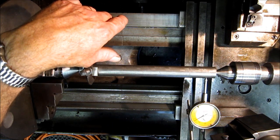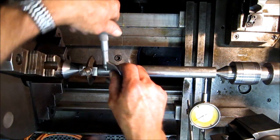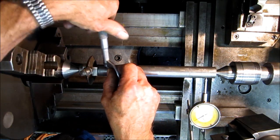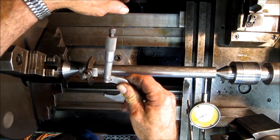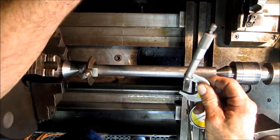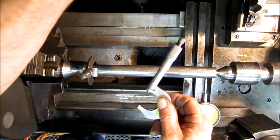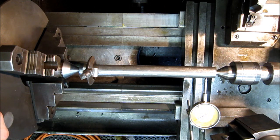Now, we could go ahead, and I think we will — we're going to adjust our tailstock right off the bat because this material here is miking up three under one inch exactly. Two and seven tenths under there, so it's pretty round and the diameter's holding well. So we're going to go ahead and crank it three thousandths over.